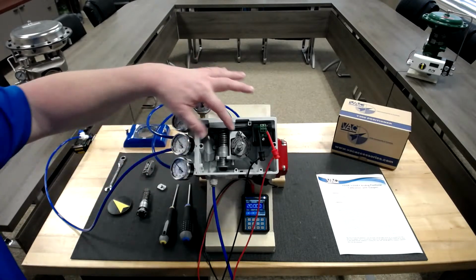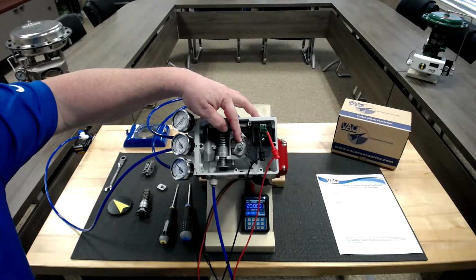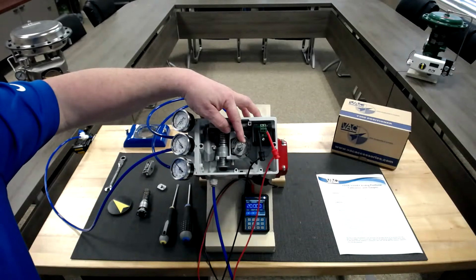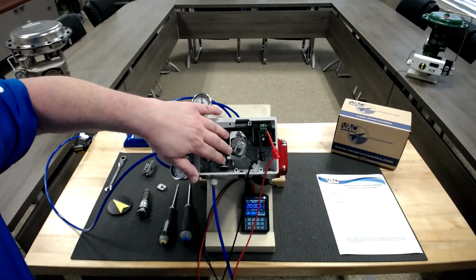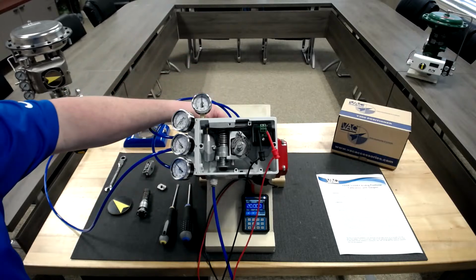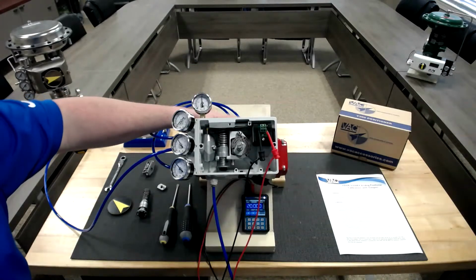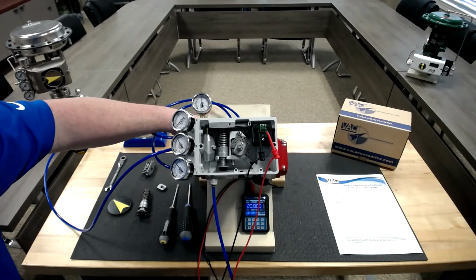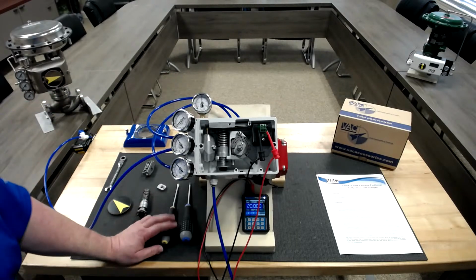One step is you have to remove the cam. We would loosen the set screw, remove the cam nut, and flip the cam over. We would flip our tubing, and then we would drive. The third step that often gets forgotten is to drive the positioner or the actuator to the new 0 position, which we can do now.